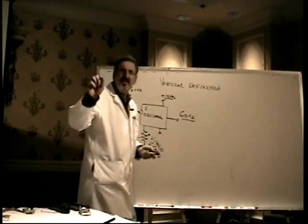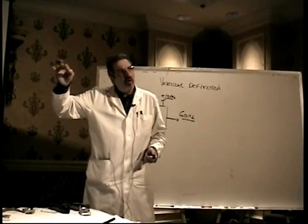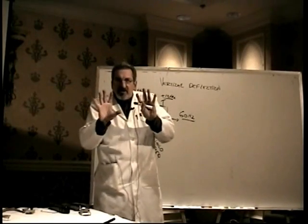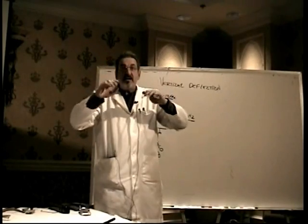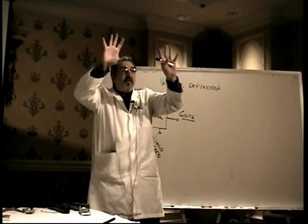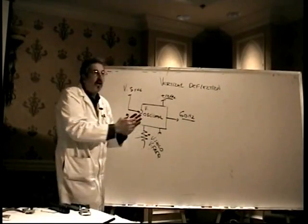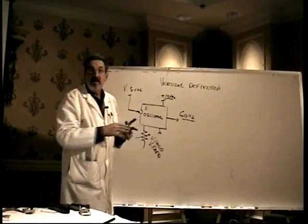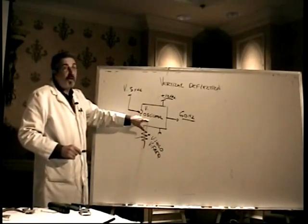And you can kind of see this if you have a monitor that's rolling. As you adjust the vertical hold potentiometer, you start to see it roll up, and when it gets close, you'll notice it snaps in place, doesn't it? It kind of goes, lock, and then it locks in place. That's when you get it within the window of correctability, I guess you might say, so that the sync can adjust it. Well, this is really reliable.